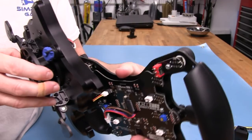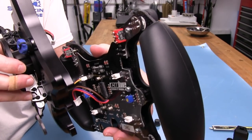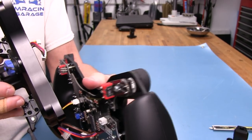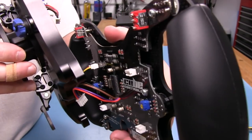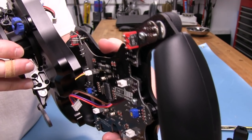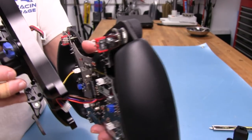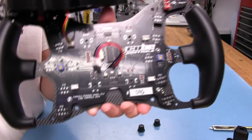It didn't want to come off that plug. And if it doesn't come off easily, even with some of the tricks I have for getting plugs off, then I usually just leave them alone. They're surface soldered or soldered right through the circuit board, and the header for the plug is pretty tight in there, so I didn't want to pull it off and maybe pull the header off too. Then I'd have to solder it back on, and big problems.